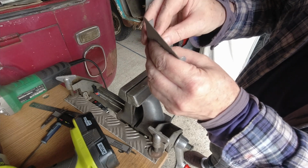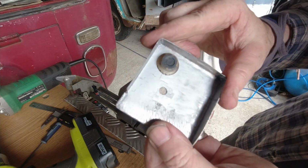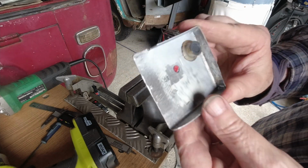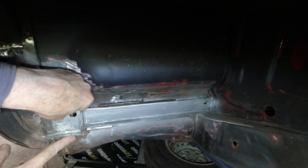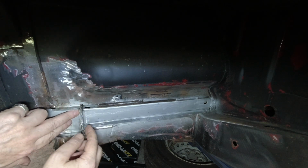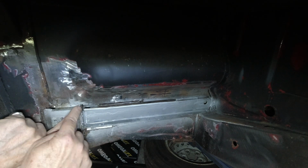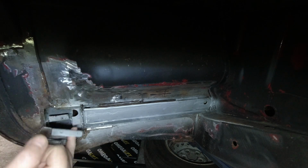I'm sure you'll have come across fasteners like this, yeah? So once that goes all the way in, that's going to be really tight, yeah? Okay. There we go. Okay. It's going to get plug welded there. Okay. And trimmed. And seam welded all the way around and across the top. We've got to trim the top, okay? So you're up to date now again. That's very nice, and the hole lines up here with what's behind it, yeah?